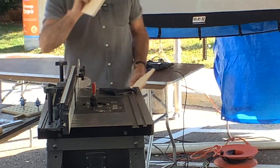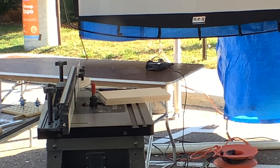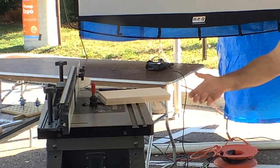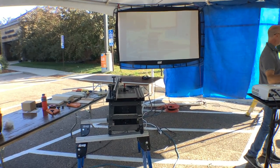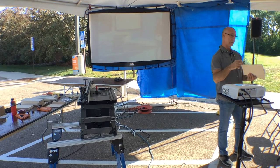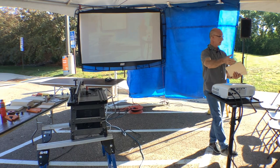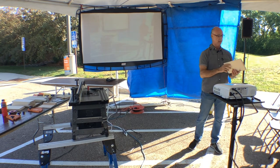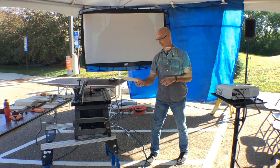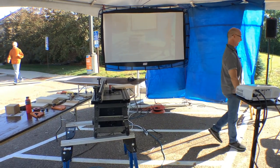We're gonna do this joint in Baltic birch plywood, which is half inch material. So as a totally non-related side note, it is interesting with Baltic birch plywood because it's an imported product. Although we call it half inch Baltic birch, it isn't really half inch, it's 12 millimeter, which is just slightly under half inch. You'll see that come into play when we do the next joint that we're gonna do, which is a little bit more thickness specific. The one that we're doing now, it doesn't play into it at all, but it's good to know when you're setting up for joinery.